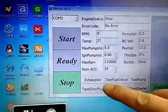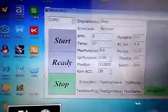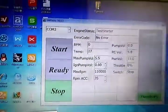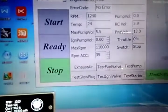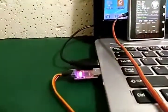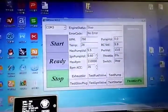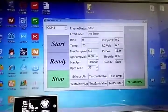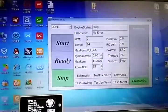You can also test the functions of the turbine, like testing the starter — now it starts running. Test the main fuel valve — now it works. You can use the digital port to connect to any radio remote control and flying control board. Now we start the engine from my computer.